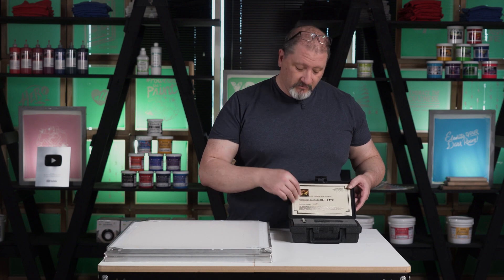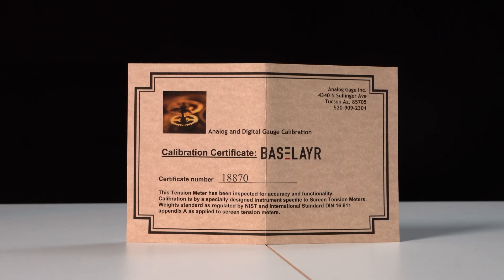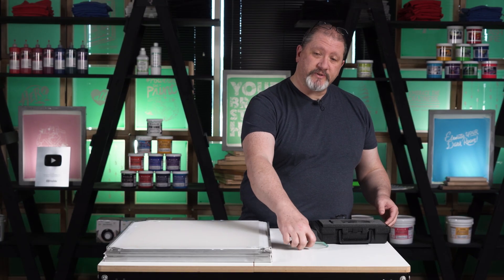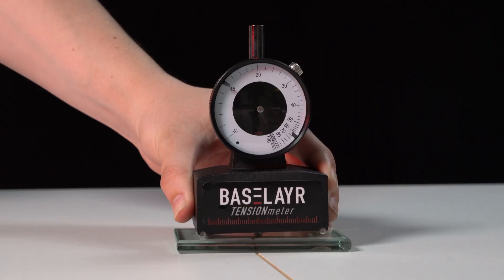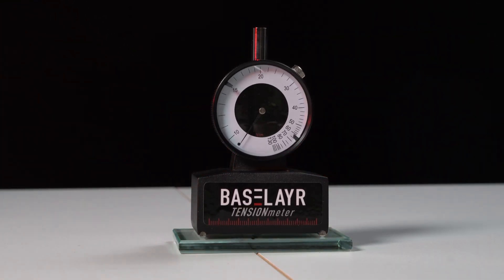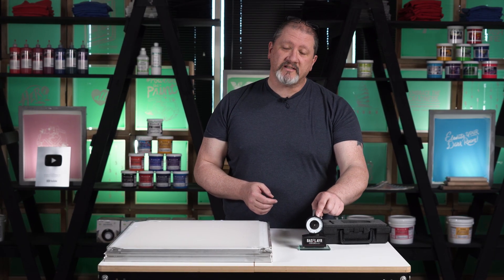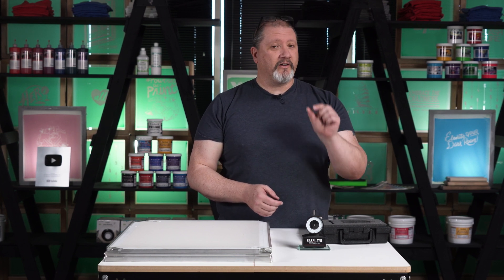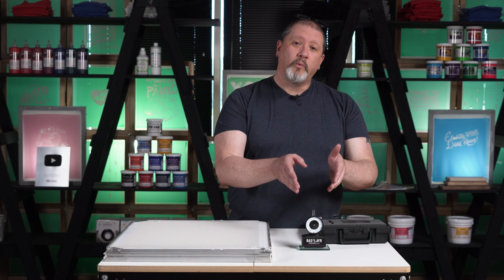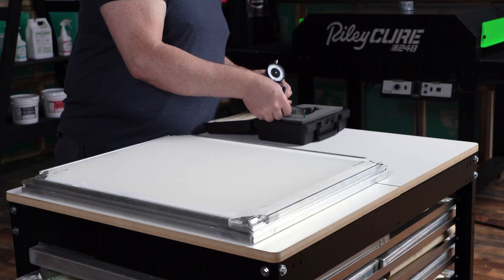It comes with a certificate that tells you when it was last calibrated and who did the calibration. You're going to have a piece of glass that helps you zero out the dial of your tension meter. This is not a calibration tool. If the dot and the line on the dial do not line up, loosen this knob so you can turn the dial until that black dot is in the center of that black line. Once you have it zeroed out, remove the glass and put it back in the case.